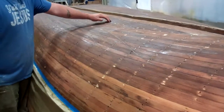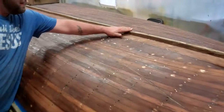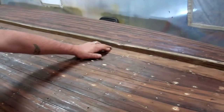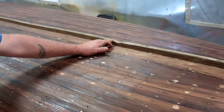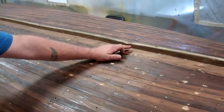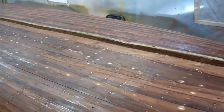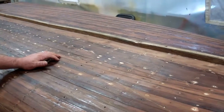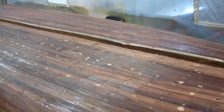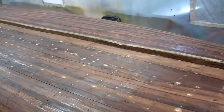But for the keel, with them being divoted down so much, my plan is I'm going to take out probably 1.5 inches on each side of each divot, and we're going to do a triangle wedge Dutchman. That way it's still going to have plenty of strength, and of course with pressure going down, we all know the triangle is the strongest shape out there.